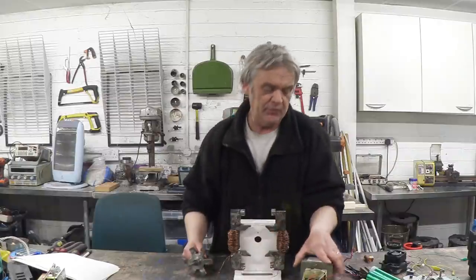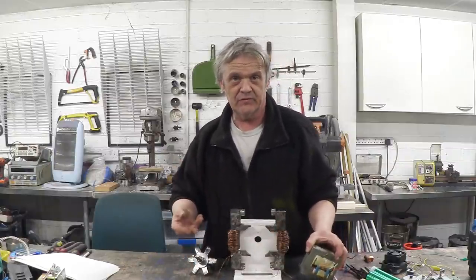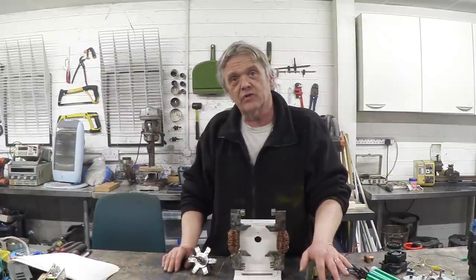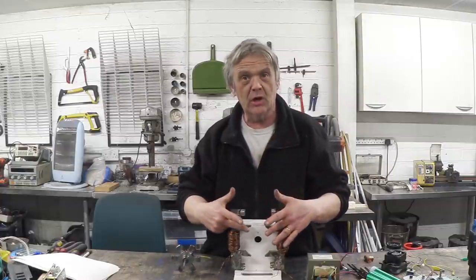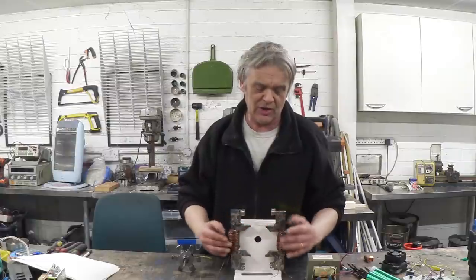What I did was cut up the I-section and E-section as I went through in the previous video. But you don't need to do that — I only did that because it uses the steel laminations. These are silicon steel meant for this kind of magnetic effect and so they work really well, but any piece of steel is going to do this job. So if you don't have a microwave oven transformer you can just use bolts — make a hex here, put some bolts in there and it'll work just fine as long as you have this arrangement of magnets and coils.